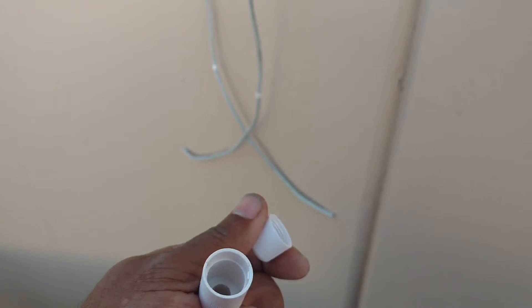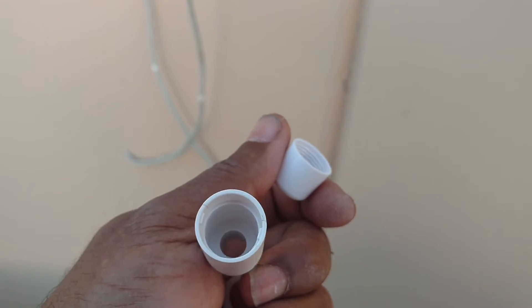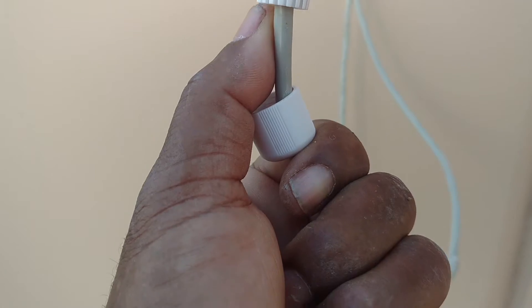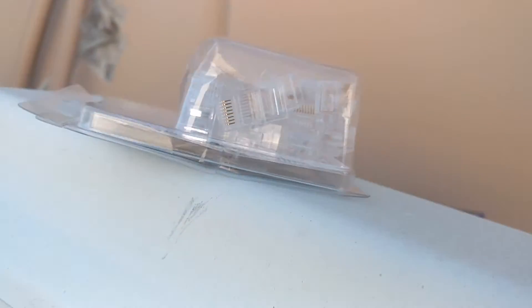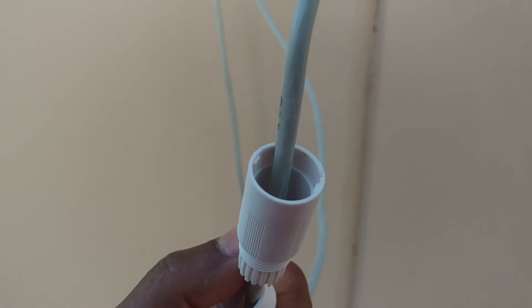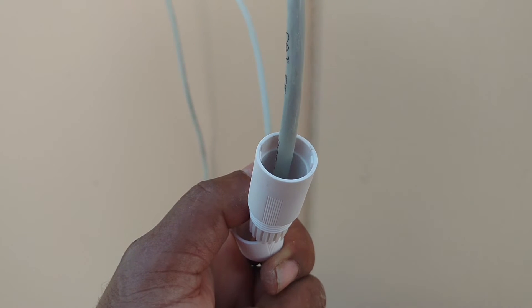First thing you want to do is thread these parts through the wire. I'm going to put this on first, then the small rubber one, then thread it through that, and then fix the end of the wire onto the connector. There's the base, there's the rubber seal, there's the sleeve. So now I'm going to fix the end of the connector — one of those on there in the B arrangement — and then I'll be able to put this seal on, connect the camera to the wall, connect the wire to it, and that should weatherproof it.